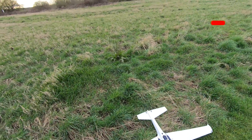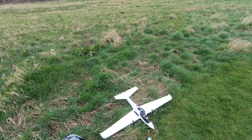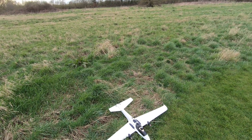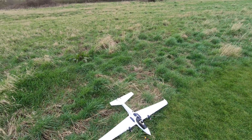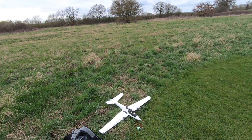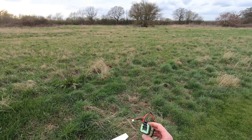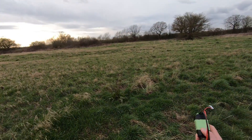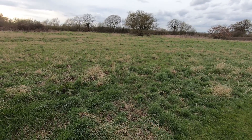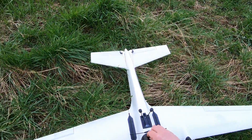So the first time I flew this, I got mixed up and thought you could put a 5,000 milliamp 4S in it. So I went and bought four quite expensive 5,000 milliamp 4S lipo packs, which just about managed to squeeze into the battery bay, but it was way nose heavy. I've since read that's not the right battery at all. Most people are flying these on 4S lithium ion packs. So I've actually made up a 3,000 milliamp pack using a spot welder I just bought off Amazon — I might do a video on that. This spot welder is so much easier than soldering. So I've got a 3,000 milliamp 4S pack and with this in it balances just nice, so I'm going to try again.